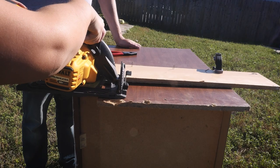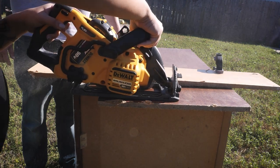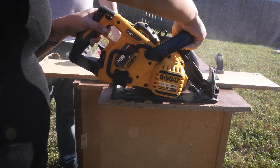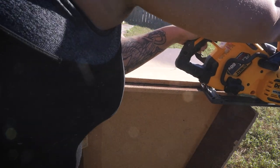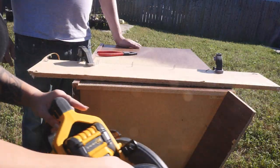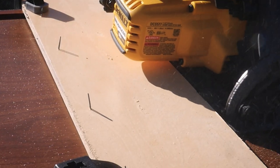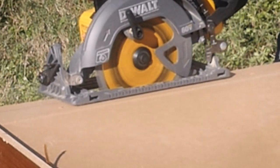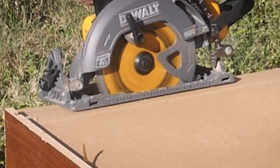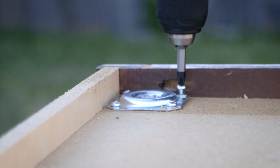And for the sides and the back, since those are just that one piece of wood, I used a circular saw to cut them off to match up with the small lip that was there already. And this actually wasn't too bad. I was dreading this part the most, but I just used the scrap toe kick as a guide and I clamped it on and then used that to run the saw along. After that was done, I added the four legs onto the bottom.